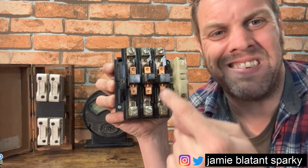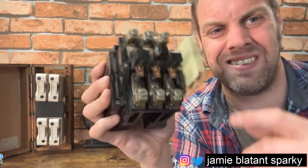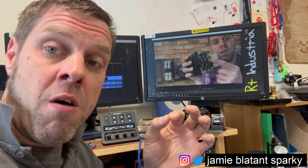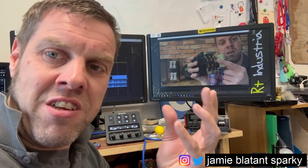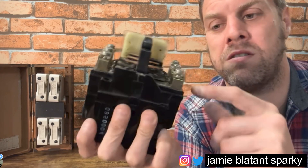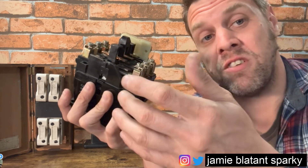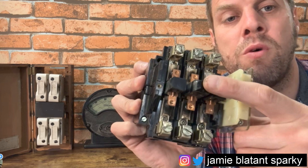Basically a contactor is a collection of three normally open contacts - well it's six really, because you have linking bars, a bar situation in the middle. You've got on that side and that side, so it's three phases through. The reason it's not a switch with one contact surface is because there'd be only one contact surface - but over those linking bars that link two contact surfaces, the arc is quenched over the two surfaces. So as they come together the arc is drawn, and the fixed amount of energy in the arc is spread across two individual arcs, reducing how bad it is so it doesn't erode the contacts all the time.